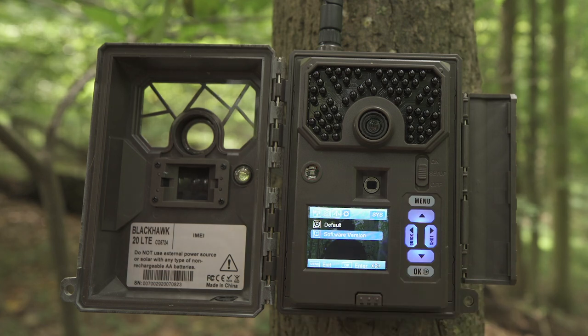Please note your camera is equipped with an auxiliary power jack. The jack necessary to make the connection is a standard four-millimeter jack. Covert offers an auxiliary cable to extend your battery life with an external 6 or 12-volt battery. To use 12 volts, you must use the Covert auxiliary battery cable. We also sell a Covert solar panel to directly hook up your camera. For optimal battery usage, your camera can also use a mini USB cable to hook up to your computer or TV to view your photos.